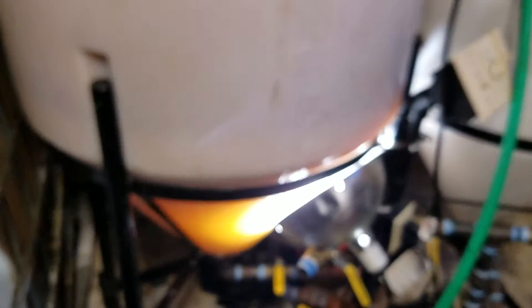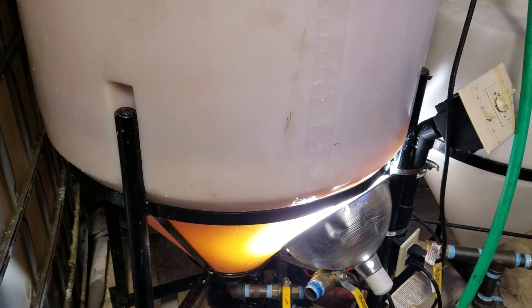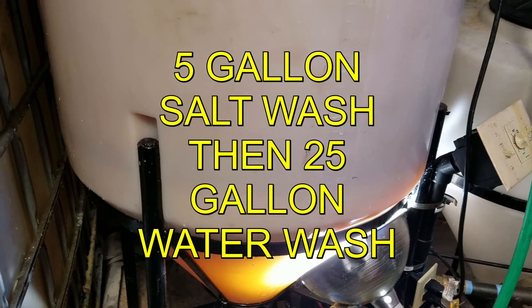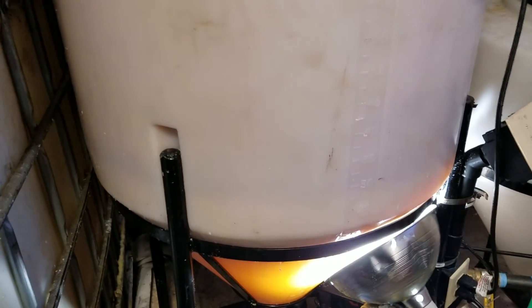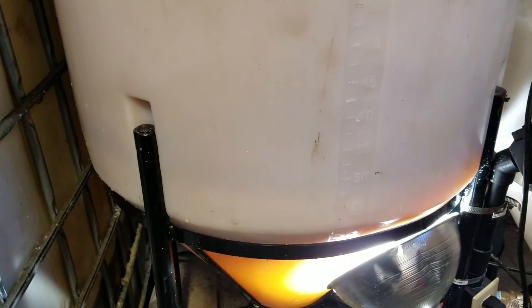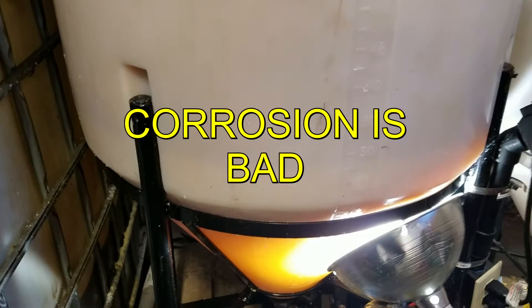With research, we've actually found that you can do 16 cups of salt to 5 gallons of hot water for an 80-gallon batch. Within an hour, this should easily divide into your soap layer, water layer, and biodiesel layer. You just need to make sure that you do a regular water wash afterwards, because salt is drawn to water and it hates biodiesel or oil, so it allows you to quickly and easily wash that salt out so that you don't get corrosion in your engines.